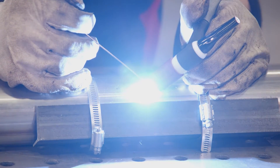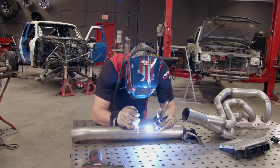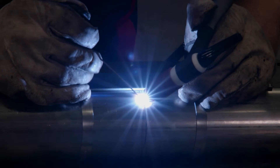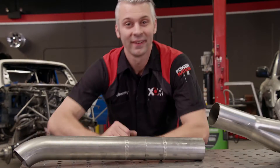This works great when you're working on the bench or under your rig, and the larger the angle iron the more surface area it covers. This technique works really well on any size pipe or tube. A rule of thumb: as the pipe size goes up, so should the size of your angle iron, and that seamless joint makes it perfectly easy to weld.